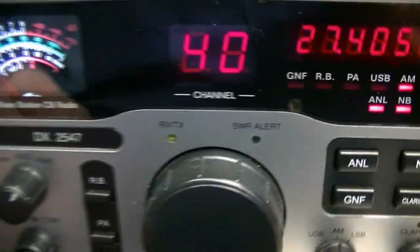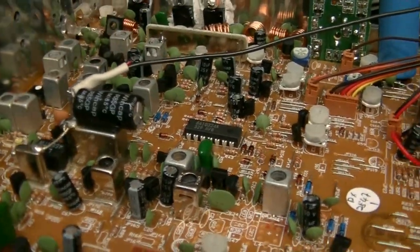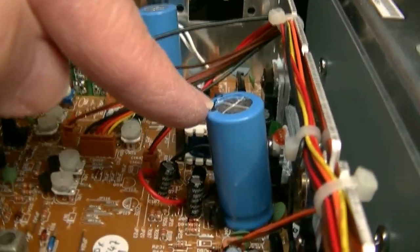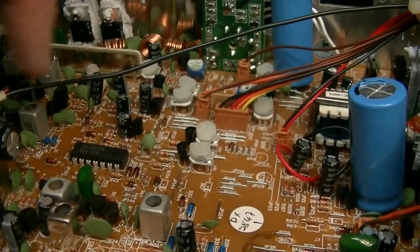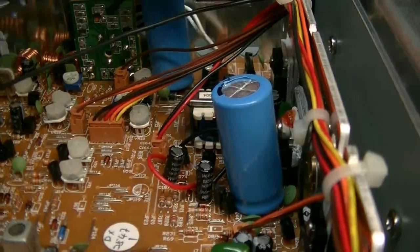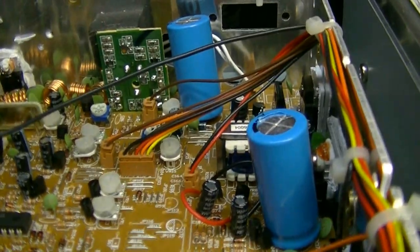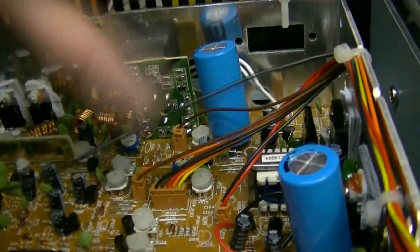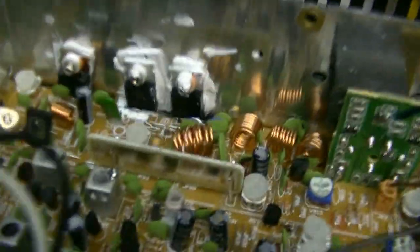There's a lot of little things I don't like, like this capacitor. It's an added capacitor, which is a good idea. He added that capacitor for the voltage regulator, but you don't need it because he also installed a 4700 microfarad cap right there. The only thing this wire is doing is running direct to your voltage regulator and acting like an antenna, picking up RF from the output section and feeding it back into your voltage regulator. That's a bad idea - I'd take that out.